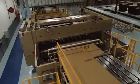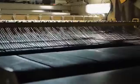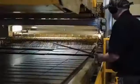After the board is slit and scored, it continues to the cutoff knife. The cutoff knife cuts to the precise dimensions requested of the finished corrugated sheet. Most corrugators have an upper and lower knife, so that two different orders can be combined to run on the same width and grade of paper. There are exit rolls that eject the cut sheets onto belts that shingle the sheets to the stacker bays.